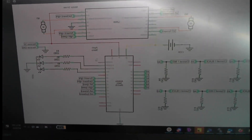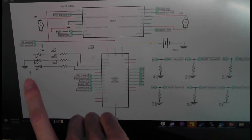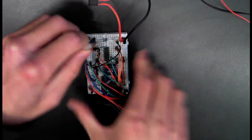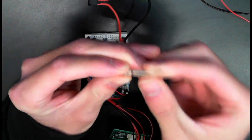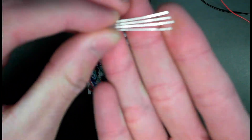It should be the only resistors you have since you've already used your 1Ks. Grab three of those — we have an extra there just in case you lost one. According to the schematic, they should be connected to pins 12, 11, and 10, and they have a common ground. So that should all be grounded together or connected to the common ground. On your breadboard, go ahead and grab your LED and look for the longest lead on the LED.